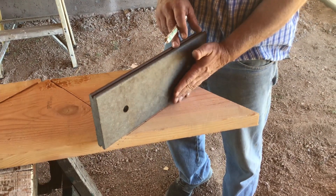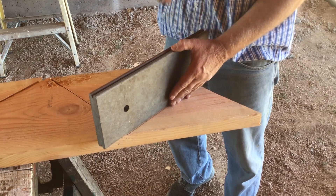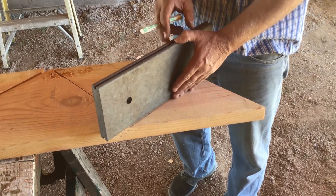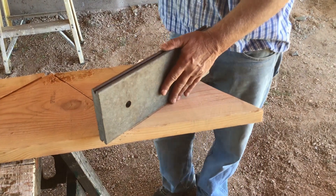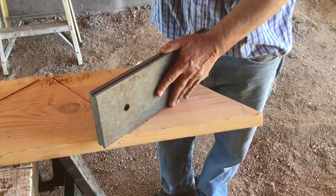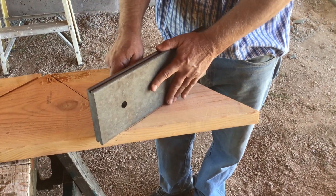I've already subtracted the width of my tread from the bottom of the heel. I'm going to go ahead and subtract about another inch and an eighth because I'm putting a piece of Trex deck on the bottom side to keep my material up and out of any moisture. Since this is kind of an exterior stair, I think this is pretty good insurance.